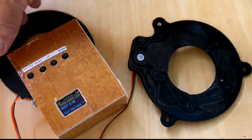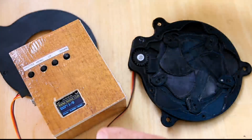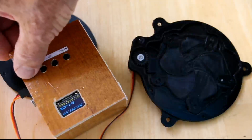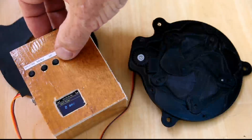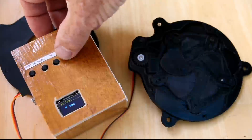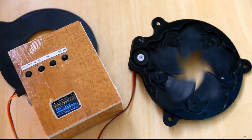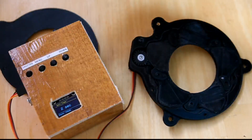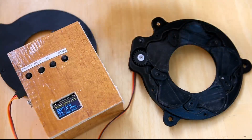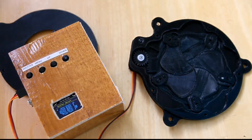One-eighth of a second is the fastest shutter speed. When you press shutter it says 'state open for focus'; when you press the button it says 'closed and ready' — meaning the next press will take the picture. We also have a self-timer: press menu and you can invoke a self-timer for up to 255 seconds. You press the shutter and it counts down before taking the picture. While in the self-timer menu, if you press shutter it opens the shutter for focusing, and then you can go back and take your picture or press shutter to close it before taking your picture.